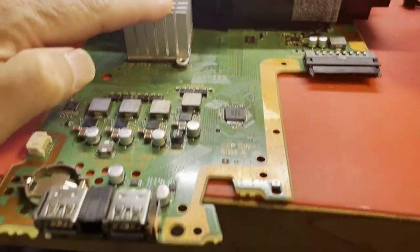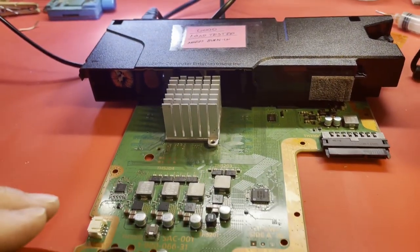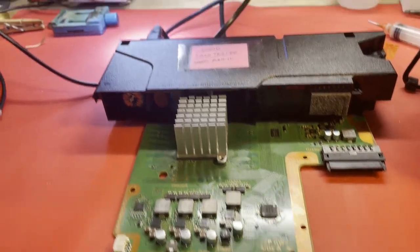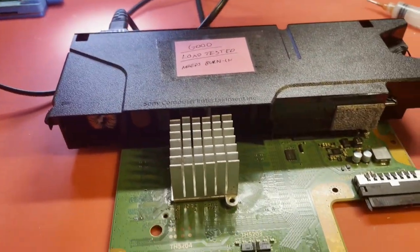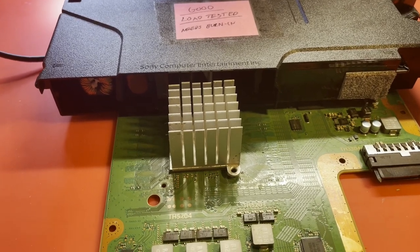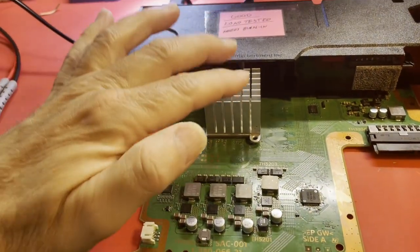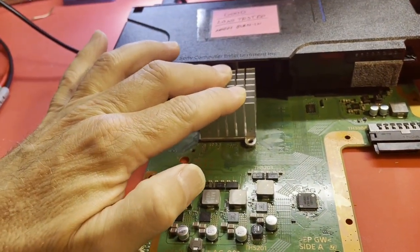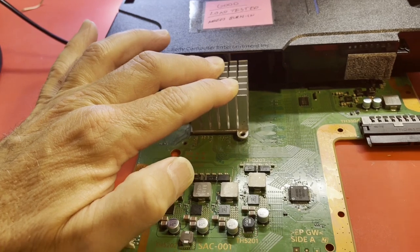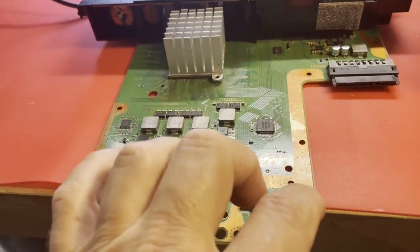We're overheating. So I need to push down on my heat sink. Okay. Let me turn off the AC again. See if we can stay up long enough to give us that message on screen. I need to push down on this a little bit better. There is some fresh thermal compound under there, but I have not really squeezed it and pressed it out.